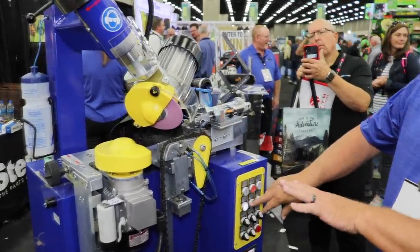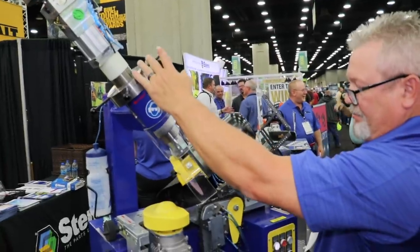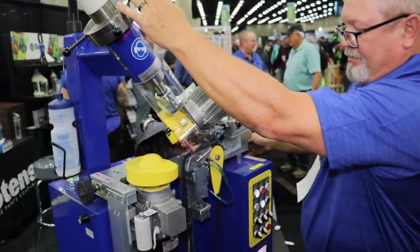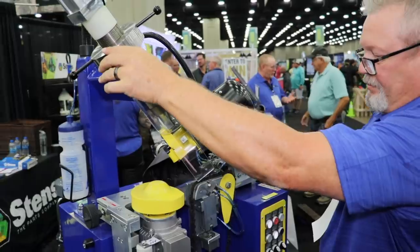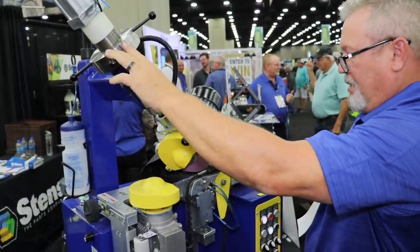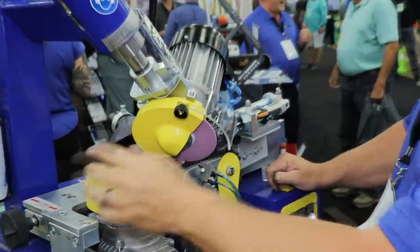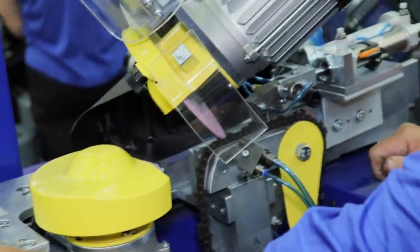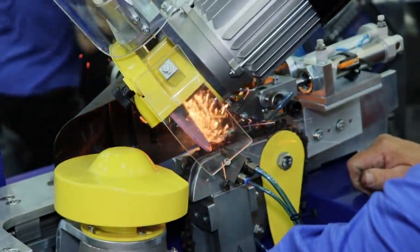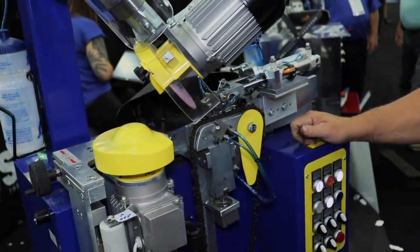Once I get everything close, I'll hit auto, start. My hand goes here and here. Tell it how much to take off. I'll turn on the depth gauge, raker poles. Barely touch them because you don't have to take much off. Just enough to get a little spark.